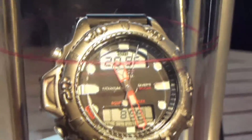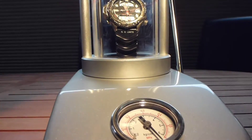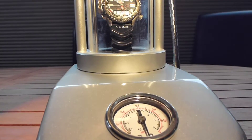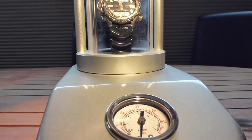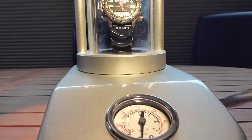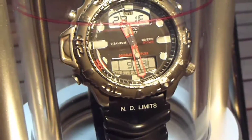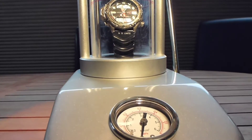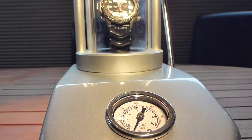It looks like it's holding pressure. Because the device has many potential points of failure, I wanted to know how high the pump could bring the pressure and how well the device could hold a high static pressure. There are 10-bar units that look identical, with the only real difference being that their gauges go higher. I just wanted to see how well this thing did beyond its gauge capacity. We're now at 230 feet and it's holding the pressure fine — not losing any pressure, which is a good sign. The pump is still pushing the same amount of air in even at high pressure, which is also good.